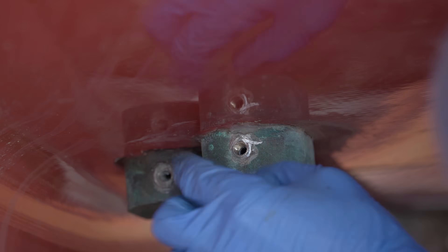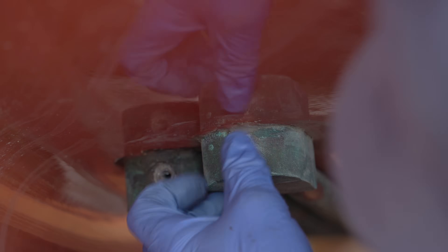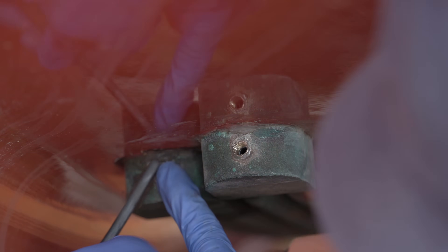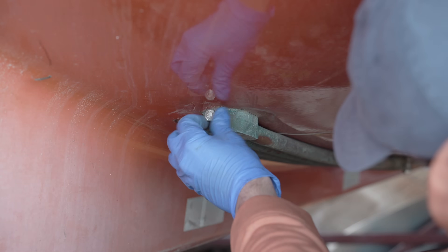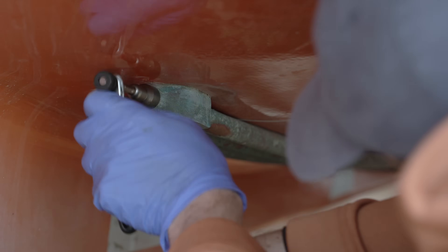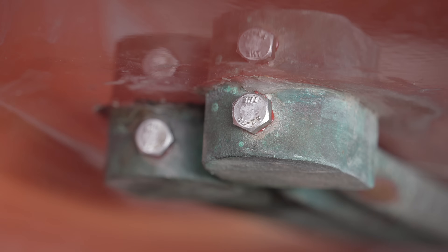I decided not to damage the protective weathered cupro-nickel on the outside by sanding or brushing too hard. But a quick tidy up seemed sensible, in case any detritus got into the threads. There's a question mark about how many little bits of flaked paint or PTFE tape are trapped within the cooling system, but since there were no circulation issues before, I'm just being careful and trying not to introduce anything new. I could finger-turn the bolts roughly halfway, with some resistance that told me that the tape was creating a seal, and then the rest needed my mini ratchet socket. It was an impulse purchase from the famously idiosyncratic central aisle of a budget supermarket. I added a little circle of hylotite sealant for a belt and braces seal.